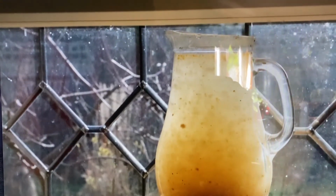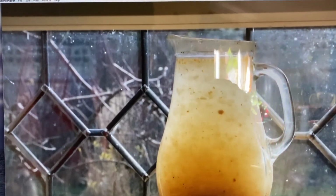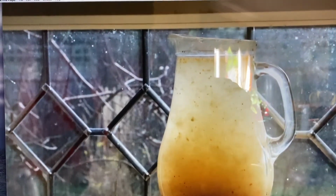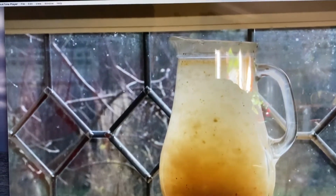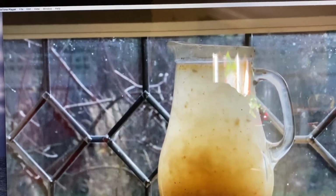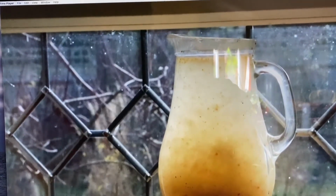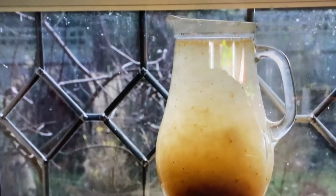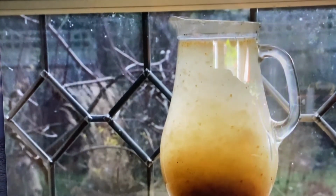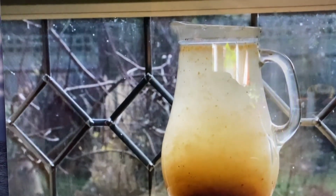And this is in actual time, remember, so you don't watch this video forever, so you know what's going to happen. This is all going to settle out and leave clean water, or milky, what they call wastewater, after it's been separated, to go into the next chamber, which is the treatment section. And it makes it far more easier. This is off my computer, this is in my library. Here you go, that's in actual time where you've been watching this, and you can see how fast it's settled.